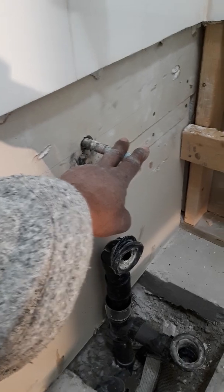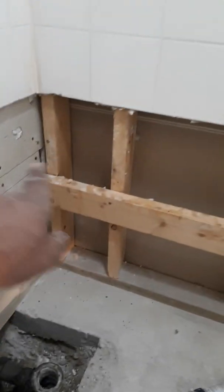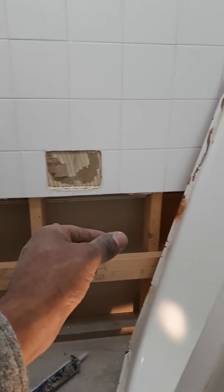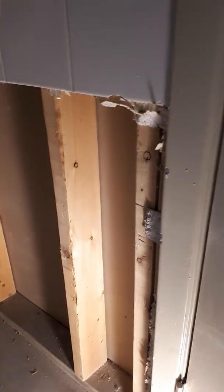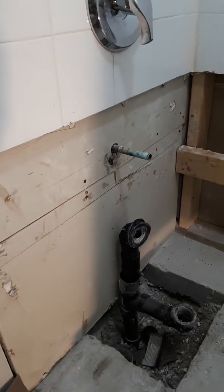You will still need to remove the spout because you need the lift out area to get out, and also cut it evenly all the way around with a tiny piece of lip that remains. We're going to tie into that with mildew resistant drywall, lots of silicone every joint that goes around. You're going to cut it all the way around here, and then remove the old tub, and we're going to be reinstalling a new tub.